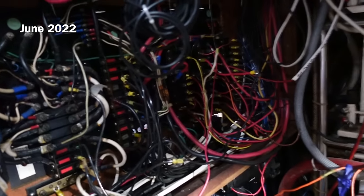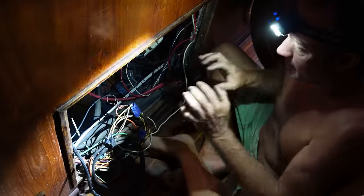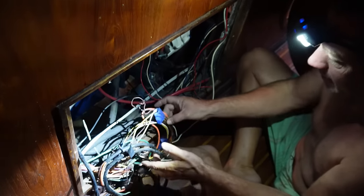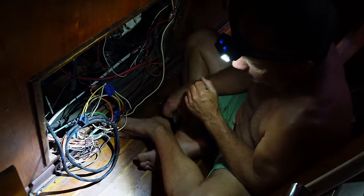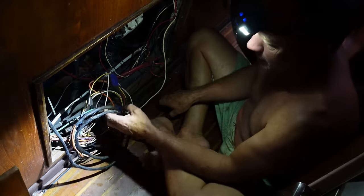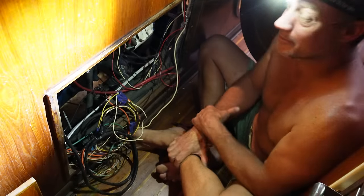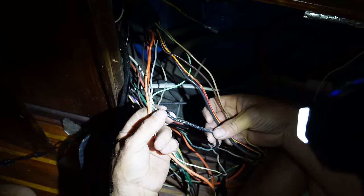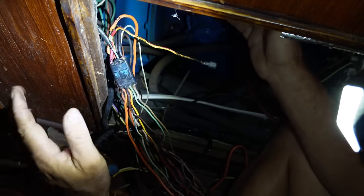This just needs to be tidied up. We've come from the ground up with the batteries to the Victron gear and all that's top notch. So this is pretty much our last little bit of mess, and then everything else is just very easily serviceable. At least we know what we have once I clean this up. It's been a big concern because I'm just not a fan of all this stuff - you can have things shorting out, things catching fire, melting. As today's task, pretty sure it's going to consume a lot of my time. We'll start with just a terminal block, labeling, and getting them all cleaned up. It's just one of those slow time-consuming jobs that is pretty important. This is what it looks like before - joins that aren't sorted, stuff touching and arcing - it's just not cool.